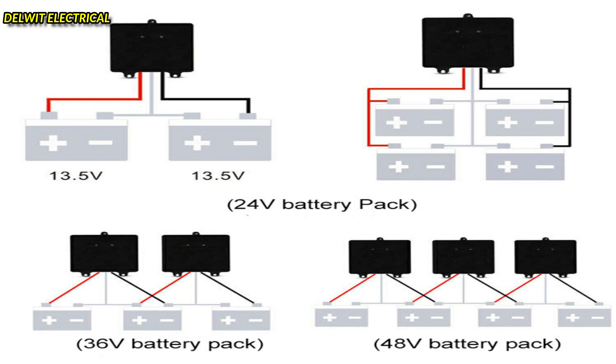This battery management system continuously monitors these two batteries. When it detects that one is charged and another is not charged properly, it takes current from the charged one and transfers it to the other. For a 24-volt battery bank using four batteries, you connect two batteries in series, then another two in series, and connect the two sets in parallel.